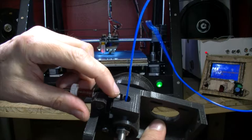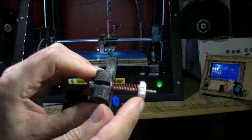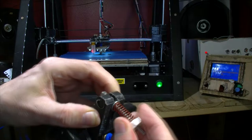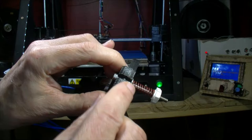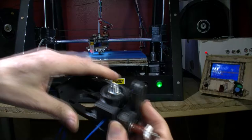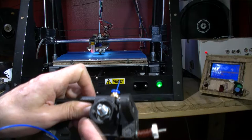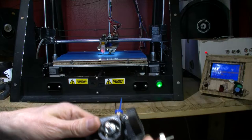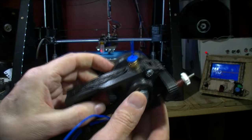That sort of allen bolt here — you do need one of these allen bolts that has a smooth shank, with only threads on about 20 millimeters at the end, so that it can slide against the washer in there. If you have teeth all along the bolt, they just grip and stick on the washer as you're moving it. This part will be fastened to your printer frame — there are three holes in there.